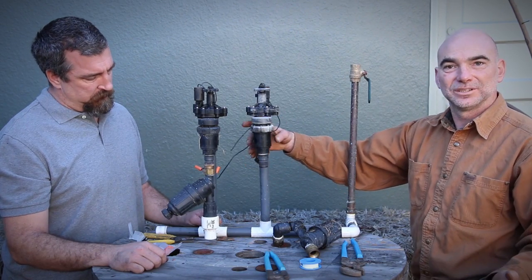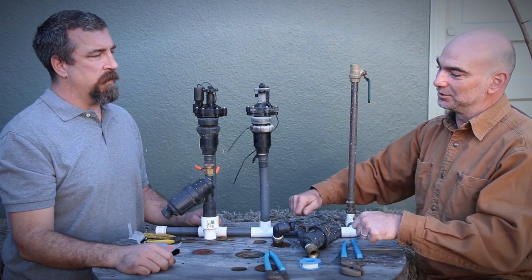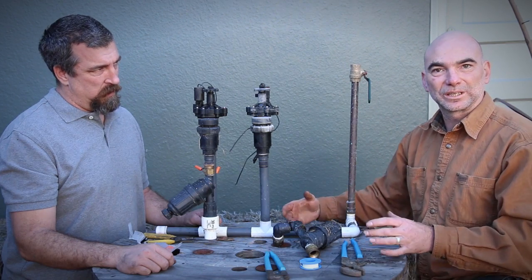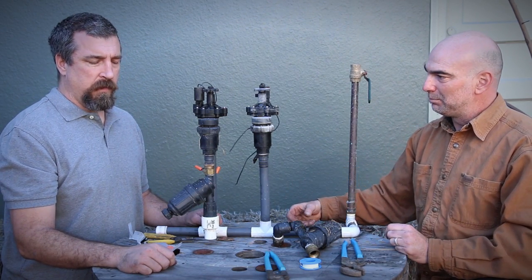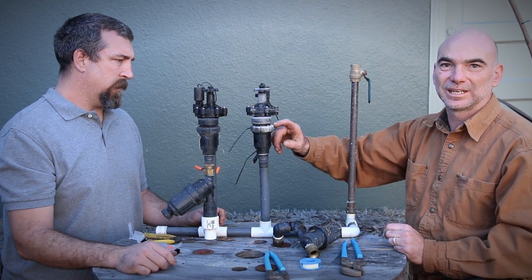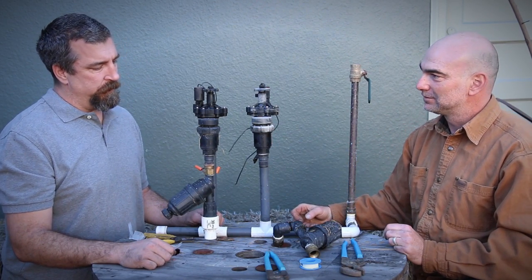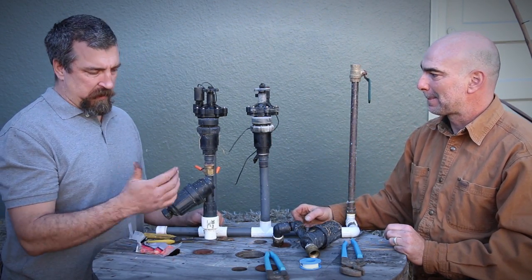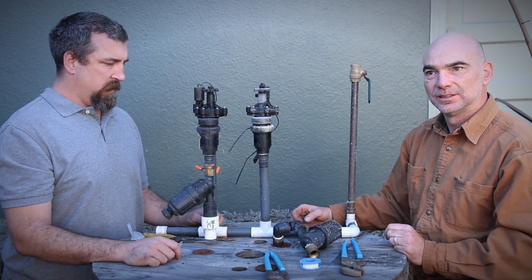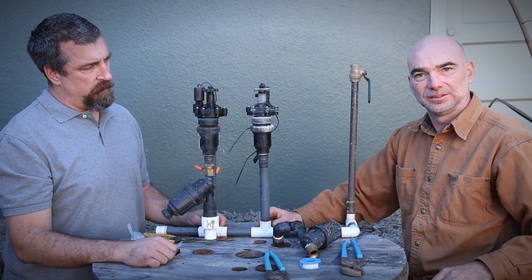And you've got these valves. These are above grade valves, anti-siphon, and then sometimes you might have valves in a box underground, and they're going to look a little different, and they could be trickier to work on just because you're working in a hole. But you can. The way they work is generally the same, except they don't have a backflow device. They'll have a backflow somewhere else. And then for drip, this is filter and pressure reducer, to get it down to drip pressure. For spray, you don't need to do that. In a spray system, you just have PVC going down to the ground.